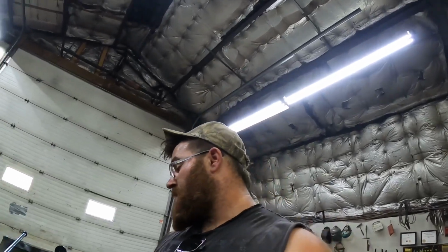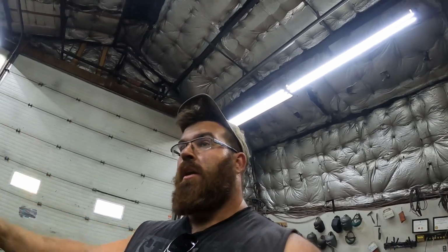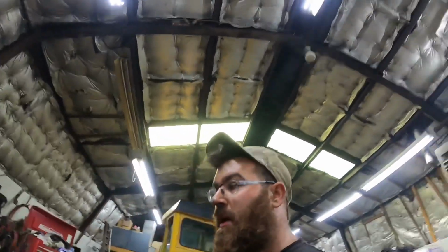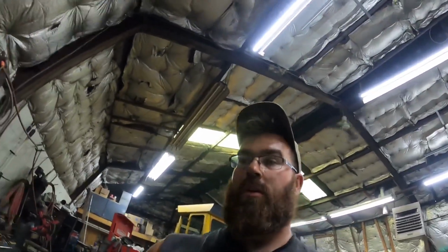I'm gonna need a hand with that, so I'm gonna get Dad to give me a hand, or Ezra, whoever's around and available, because someone's gonna have to hold the end of the shaft while one end is in the press, and try to get it straightened out best we can, because if we don't get it straightened out, it's just gonna eat the bearing on the end that's bent. So, but I'm gonna do that tomorrow.